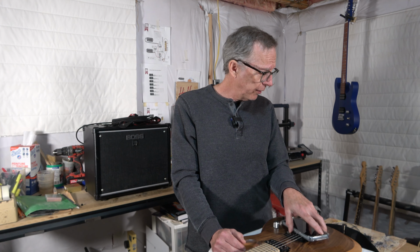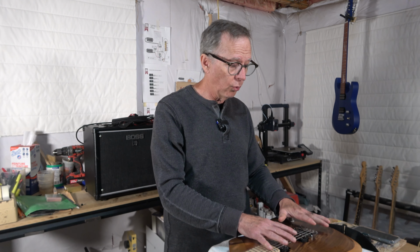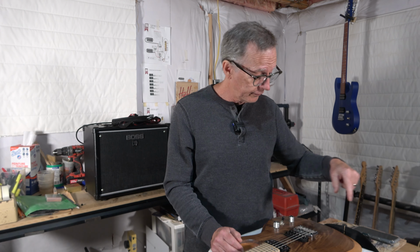And I think one of the best ways to test is to, first of all, try a couple of different guitars played through the same amp. And if you play a couple of different guitars, but only one of them has that feedback squeal, then you know that's the guitar. But if the feedback squeal happens on any guitar that you plug into your amp, then it's liable to be the amplifier or anything that's between the guitar and the amp itself.